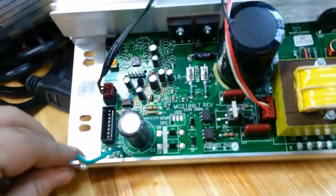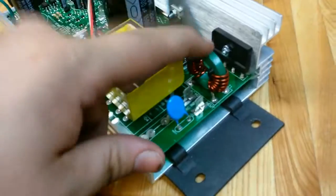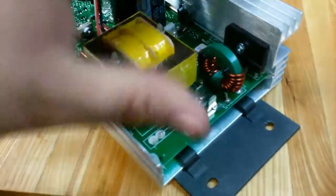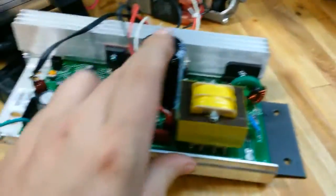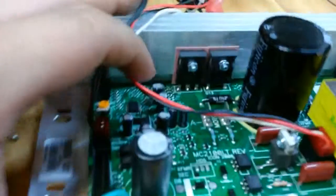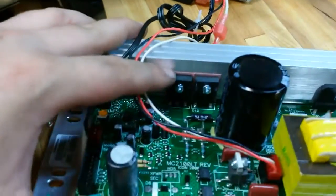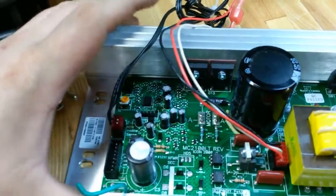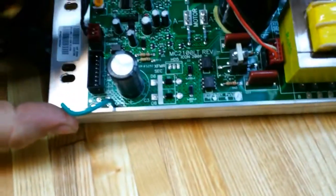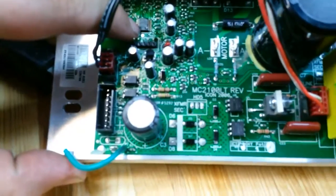As we go to the circuit board here, it's pretty simple. There's our bridge rectifier. So our power comes in right there and there. That's our voltage input. Looks like it just comes across this little ferrite core. Clean up the power maybe, who knows, I don't know. Not really a tech guy. Goes across the bridge rectifier, goes across the capacitor to clean up any ripples in the rectification. And then we have two chips here. This one on this side is a diode, and this one here we're just going to call a transistor, but it's an internally rectified, fast-acting gate, which is probably controlled by, if I had to guess, that little guy right there. That looks like it'd be maybe an Atmel, Atmega, not sure.